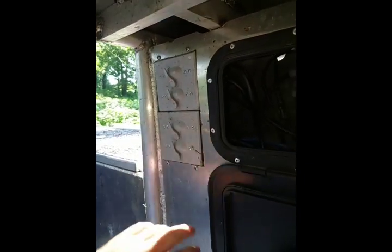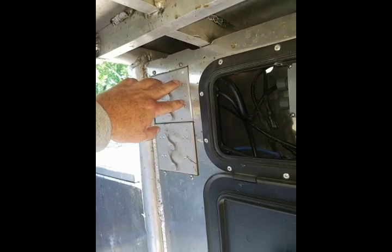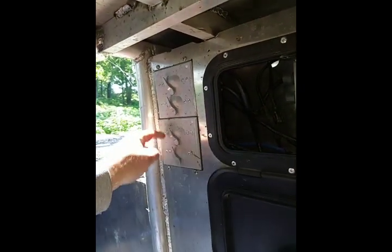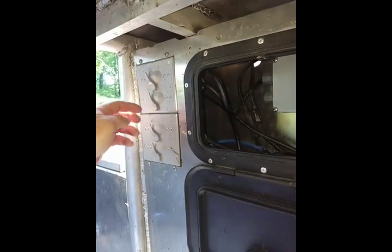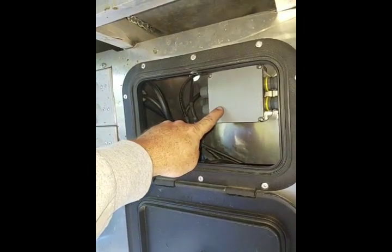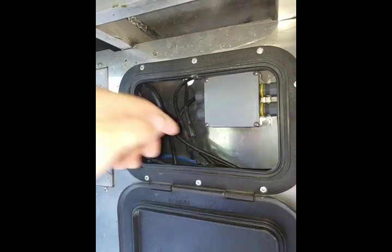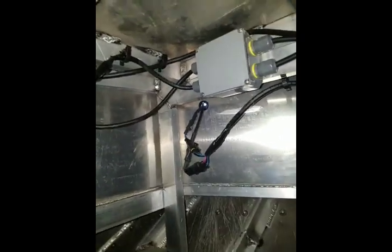Now, those 2 wires come in, and each one of them feeds each box. And then those wires are split to feed each switch. All 4 of these switches come out of this junction box and go into more 4-inch junction boxes. Let's go over here to this one, since I can get the video of it just a little bit better.